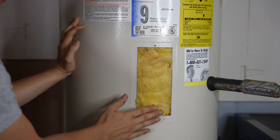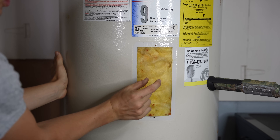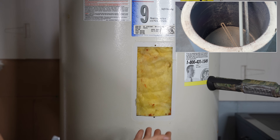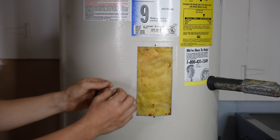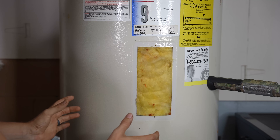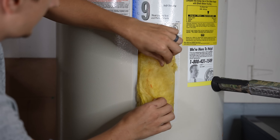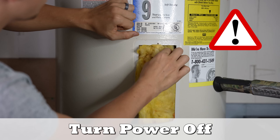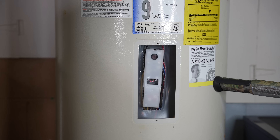The first thing we're greeted with is a bunch of insulation. This water heater has an outer shell of thin metal, then two inches of insulation. After that you have the steel tank itself, and on the inside that steel tank is covered by an enamel — basically a thin layer of glass all the way around the inside of the water heater — to prevent the water heater from rusting too early. Until that glass cracks or develops a hole, that inner tank should not rust at all. If you're going to be doing this, make sure you have your breaker turned off to the water heater before you take anything apart, because it is 240 volts.